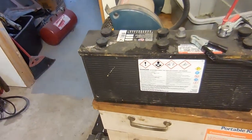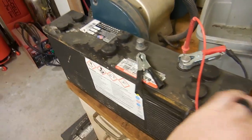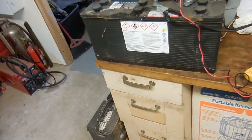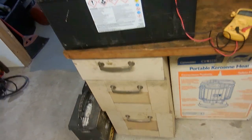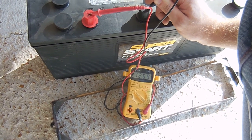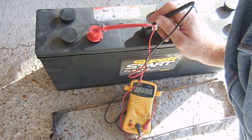Two observations about this battery: it's been leaking water and what looks like maybe battery acid, caught up underneath the hold down bracket. Something weird — I'm totally surprised — I put the multimeter on it and it says 11.4, which isn't bad for a battery that's been sitting for a while. But when I tried it in the car, you turn the key and everything goes dead. I'm thinking there's a possibility this battery is bad because it won't take a load. You put a load on it to turn the engine over and nothing happens. The replacement battery reads about 12.5 volts, which is about right. Batteries should last longer than three years even if not driven regularly — maybe the switch killed it.